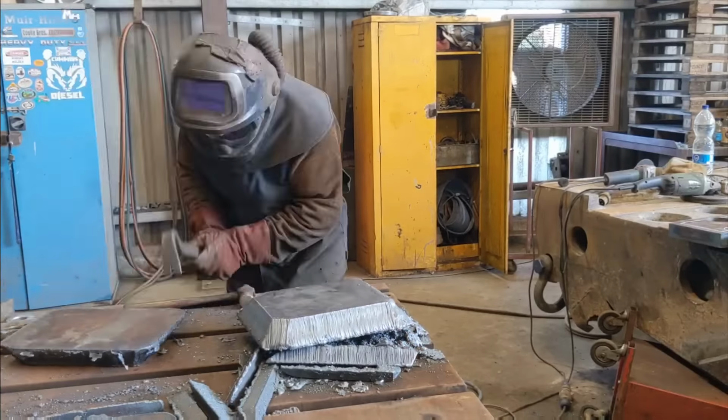So I've come to raid my MIG cupboard, and found an old axle. You can see the wear on it. I have some new replacement axles in there, along with different wire roller sizes. The only problem is, all my other rollers are goosed as well, so I'll send them all away together to get little bushes replaced, see if we can purchase some new ones.